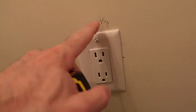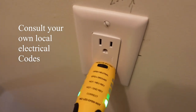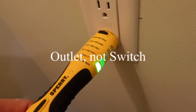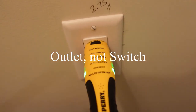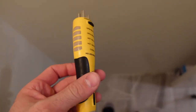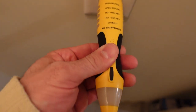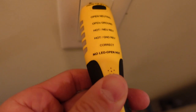As you can see, this outlet is hot. If I trip the GFCI it would kill the switch, but it wouldn't turn the power off from the breaker. Don't do that — you have to go downstairs and turn off the breaker. Don't just trip the GFCI, because the wires are still going to be hot when you disconnect things.